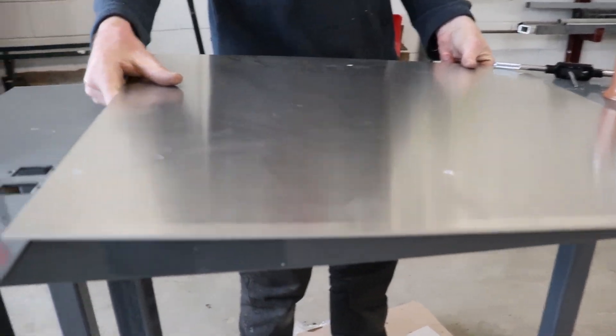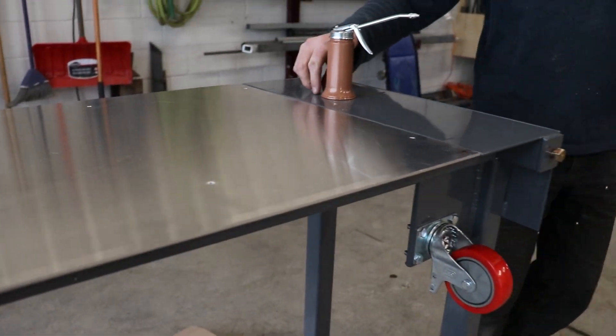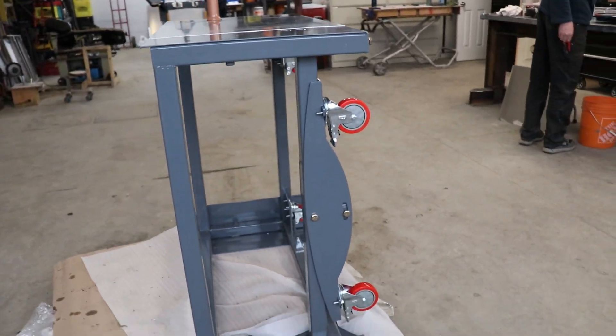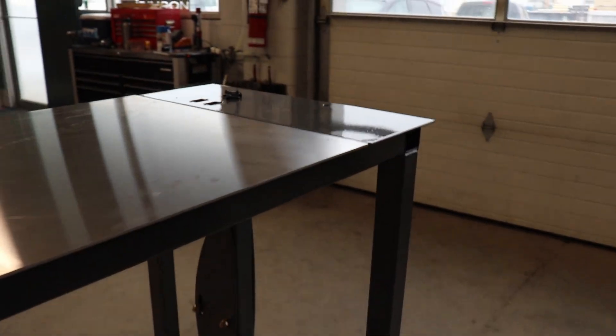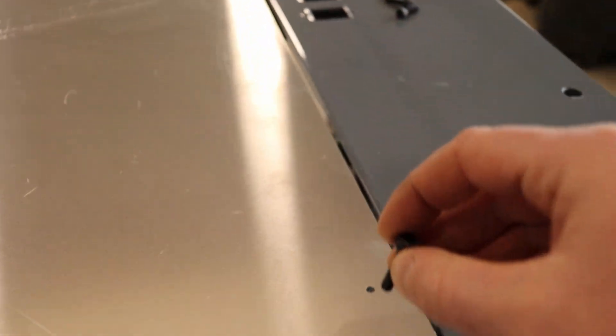We have some aluminum cuts in 1/8-inch for the side panels. Two of them are mounted to piano hinges for easier access, and the other two are bolted in place. Same as the rest of the machine, these steel and aluminum pieces on the stand were laser cut with all the required holes for hinges, bolts, and even the power switch. Once the panels are in place, we'll use them as templates to drill and tap for the bolt holes into the tube steel.